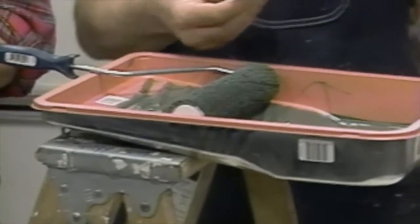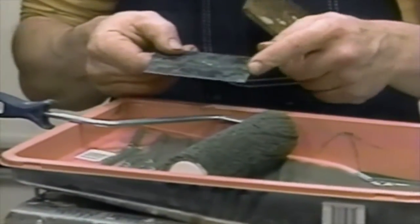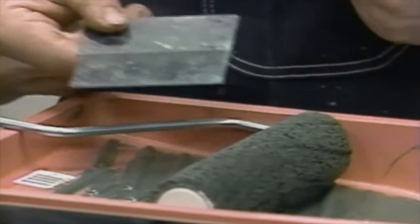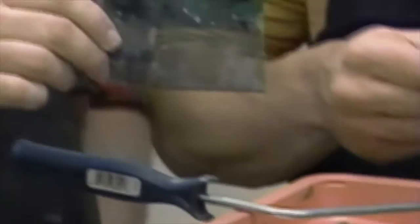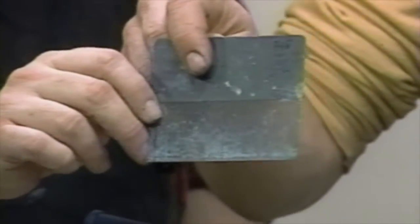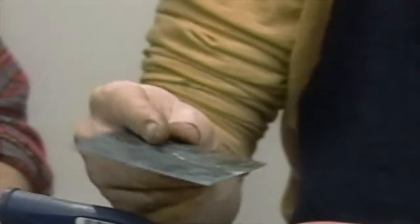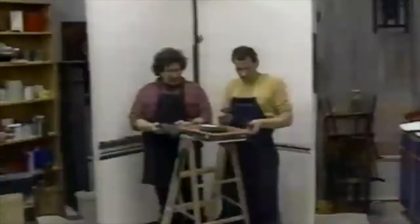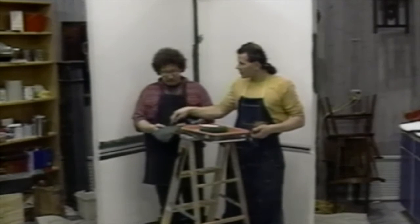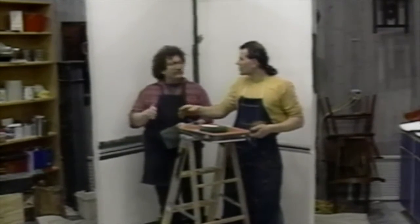I have this graining comb that I did the finish with — it's an older one and the tines, which are really steel, are smaller than the other ones — about a thirty-second of an inch. It's got the original green paint on there still. That's going to give it the fine grains of the original pattern. You'll never be able to duplicate the exact pattern, but it will give you that undulating effect that looks like an electrocardiogram.